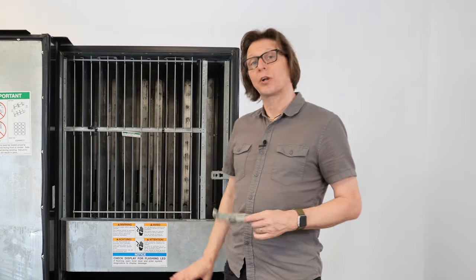We'll also check the compressor. Is your compressor coming on? Sometimes it's hard to hear that. With the dollar bill, we can check to make sure our condenser fan is coming on, because if the condenser fan doesn't come on but the compressor does, the compressor will overheat and thermally lock itself down — again, not cooling the machine. So this is another quick visual reference tool. Let me show you how I go about doing that.